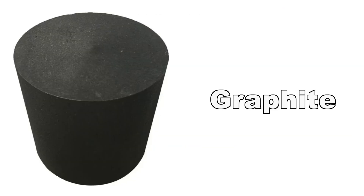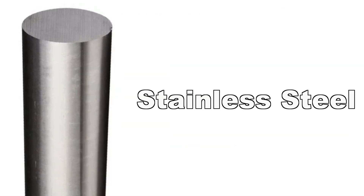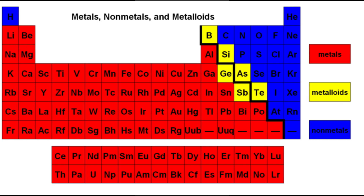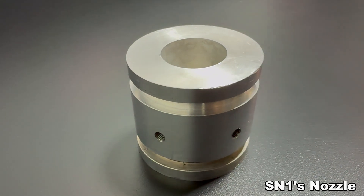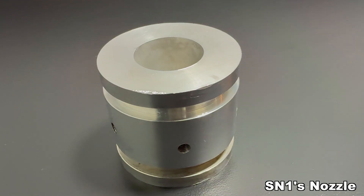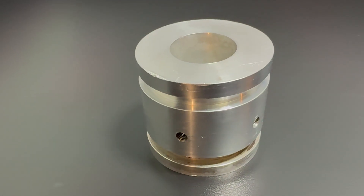There are many options, including graphite, aluminum, and stainless steel, each with their own advantages and disadvantages. For SN1, I used aluminum, but the low melting point became a problem when chamber pressures rose too high. Aluminum might work great if reusability isn't a priority, or your motor's chamber pressure stays relatively low.